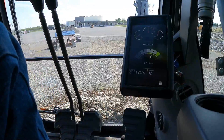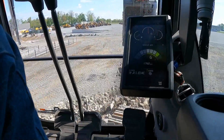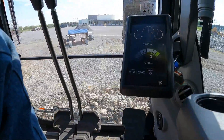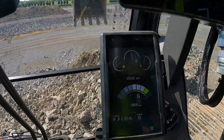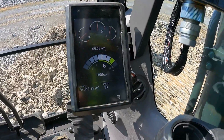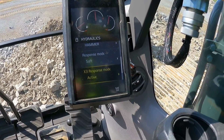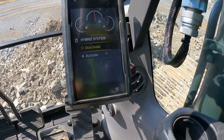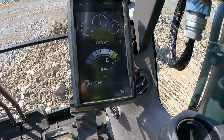It's using all that momentum from gravity as the boom goes down to fill that accumulator. The nice part is you do have the option to turn it off manually in the computer. If for some reason you're not happy with it, you go to Hydraulics, come down to Hybrid System, and deactivate — it's as simple as that.